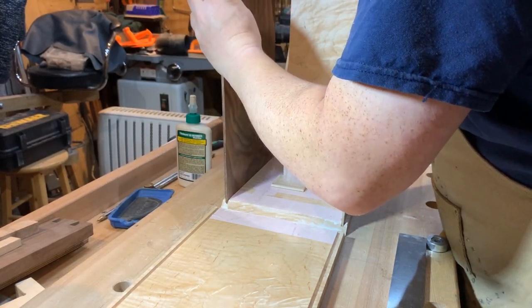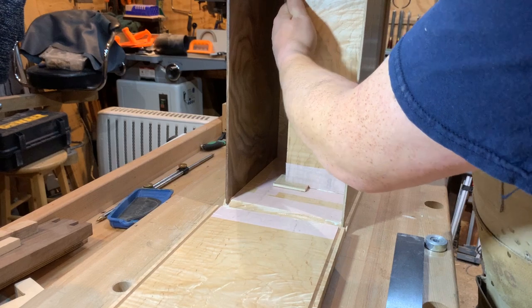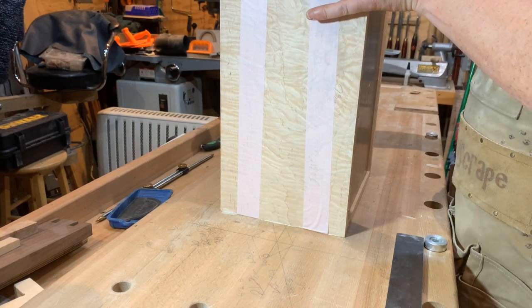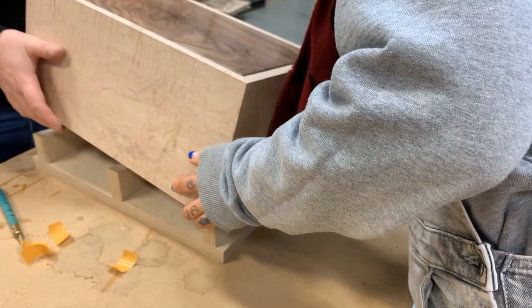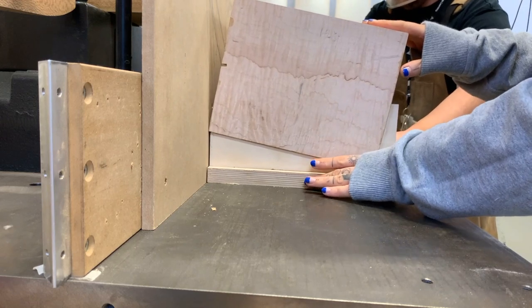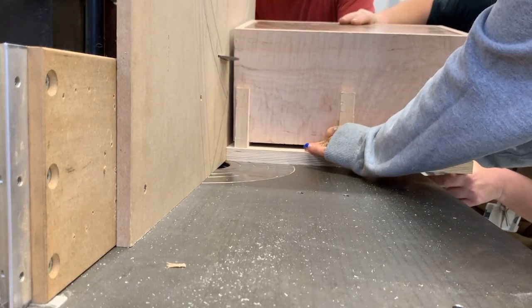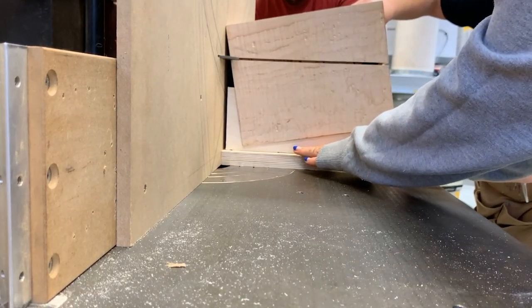The piece I'm inserting here is the top — it's a solid piece of walnut. It needed to be chamfered and be the same height as the sides of the box. The panels had bowed slightly so gluing up was quite a challenge, but I did manage it in the end. I then needed to cut the lid off, and being a writing slope it had to be at a very precise angle. So I had to make this jig, which allows you to cut it off at 10.1 degrees — with plenty of helping hands and a spindle moulder. We don't cut all the way through to make sure the lid doesn't drop down.